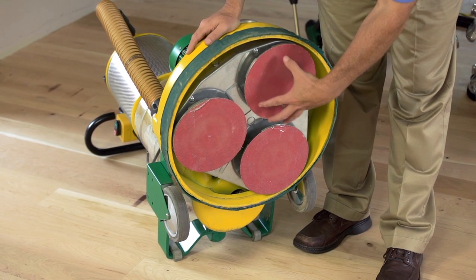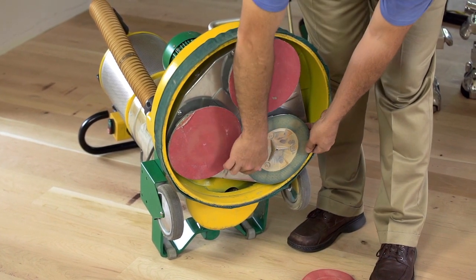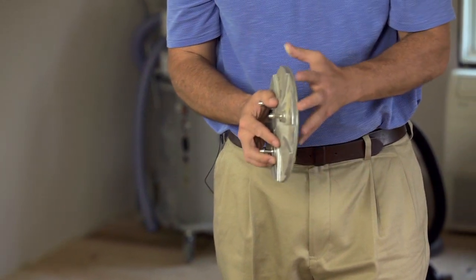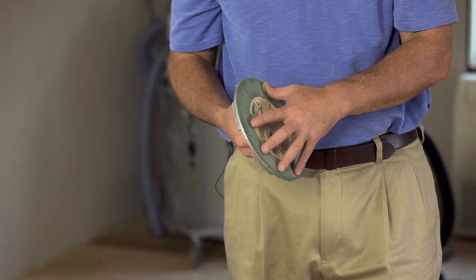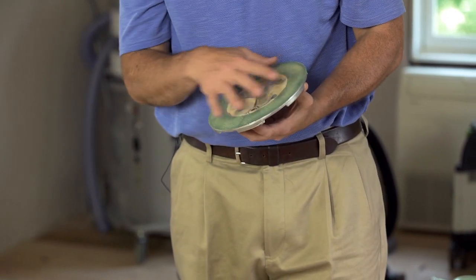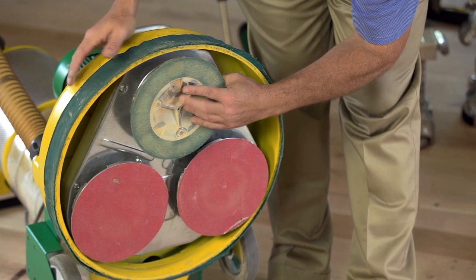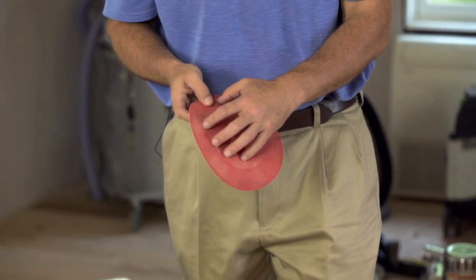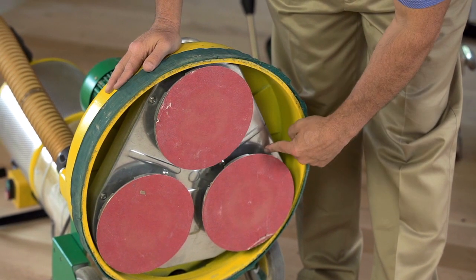The Trio runs essentially three 8-inch discs that Velcro paper onto a removable pad. These pads are interchangeable. You can use multiple heads for aggressive concrete sanding or concrete prep work on a flash patch or leveling compound. They come with a Velcro system for sandpaper, and there's a cushioning pad you can put on top to reduce the aggressiveness of the unit. They take hook-and-loop style Velcro paper and just snap into rubber grommets.